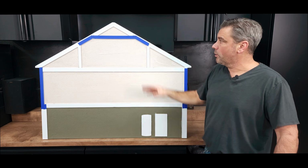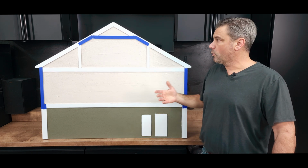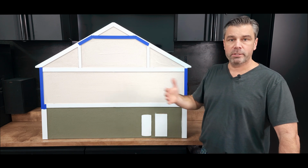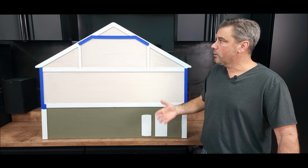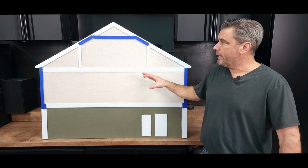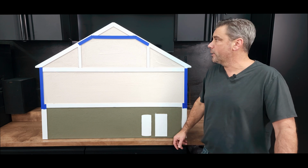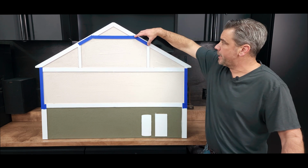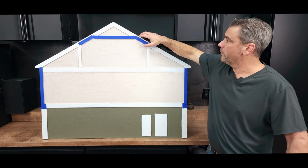So a lot of times if you don't have drywall in this room on the sloped ceiling, we would normally look at spray foaming that with 4 to 6 inches, depending on what the barrier, what they're looking for, or maybe the homeowner stuffs fiberglass in it themselves. Ideally, if you have drywall in that space already, we would normally dense pack that with cellulose. So the guys would dense pack this as a full solid barrier, allowing no air to travel through there.